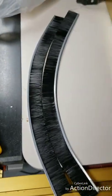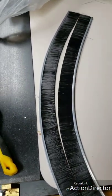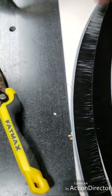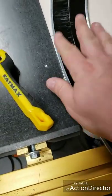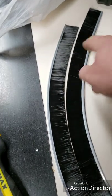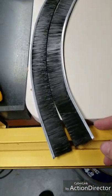A quick little nip with my snips — cut it right in half. The thing bends very, very easily, so far it's looking all right. I think we're going to have a winner. You may have to bend it a little bit just to get the brushes to touch better. You don't want to cross the bristles, but you want to make sure you seal off the gap. More than likely I'll have to trim it anyway just to get it to conform to the inside of the cabinet, but grabbing it by hand and giving it a quick test, it's not so bad.